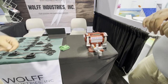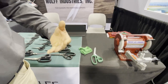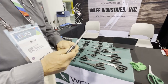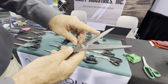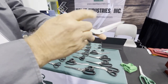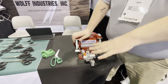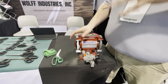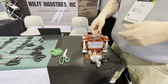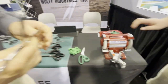Why 35 degrees? For scissors primarily cutting poultry and chicken, 35 degrees holds up real well. Over here are knife-edge scissors — a very steep angle on those. A knife edge usually has one flatter blade and one that's much steeper, which is how fabric scissors are often done. One of the things that comes with this machine when you purchase it is an angle gauge, so if you have scissors you're uncertain about, you can use that tool to measure the angle and know exactly where to set the clamp.